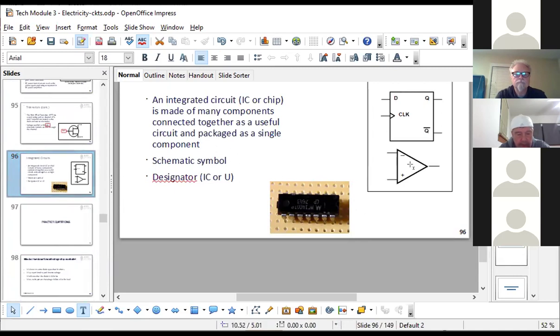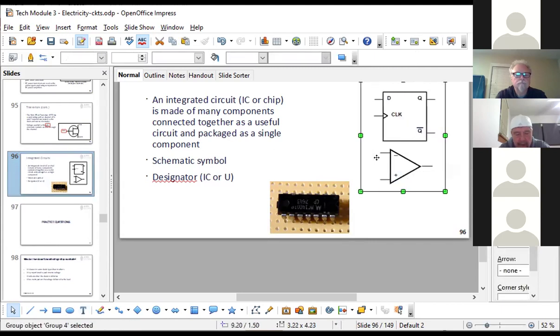Sometimes, if you put a signal in here and no signal there, nothing will come out. If you put a signal there and a signal there at the same time, then some voltage will come out. There are tables, called truth tables, which will tell you what will happen depending on what voltages you put in. Some you have to put both in, that's called an AND gate. Some with nothing in, it conducts, that's a NOR gate, and some either one, it's an OR gate. Okay.